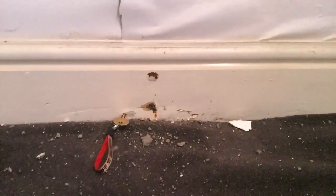You can see that the timber down here has rotten. Let me just alter the camera and give you a close look at this. If I put a key in here, you can see that the key goes straight in - so there's evidence for you that we've got dampness in this property.